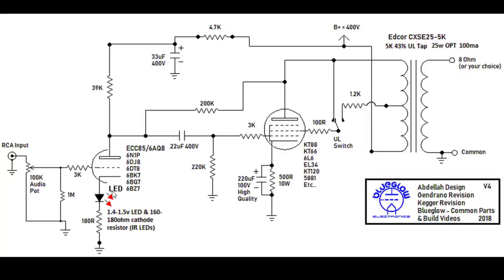A very common thing to see here is a resistor. But then you have to bypass that resistor with a capacitor because the DC and AC resistance of this resistor are about equal, and it just doesn't play out well for your AC signal. So you typically put a capacitor across that to bypass the AC to ground, which ultimately affects the sound of the signal in some ways. This is a more advanced technique than your traditional cathode resistor and bypass capacitor.